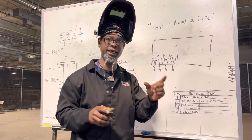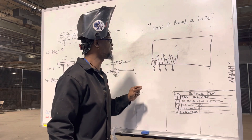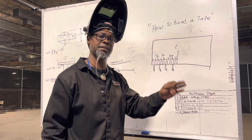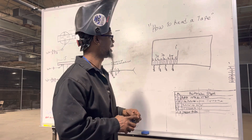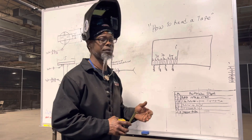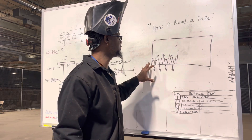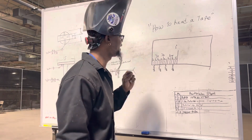If you think of it as a pie — say you have 16 pieces in your one-inch pie — every time you take a piece out it gets smaller and smaller. Now on a rule of thumb, majority of the time you're going to be working within eighths to quarters, and some things you'll see a sixteenth, especially with standard parts. Like if you were making parts, normally they'll have you cut it — it might be three foot and seven eighths, or we need these pieces a half inch long to slide into a certain piece you're welding.